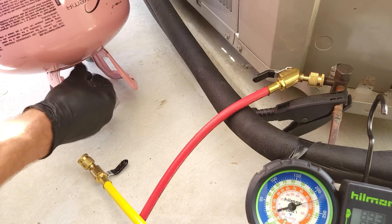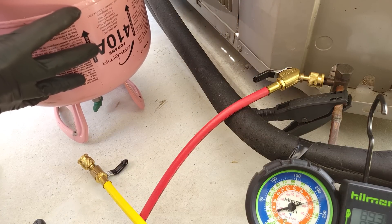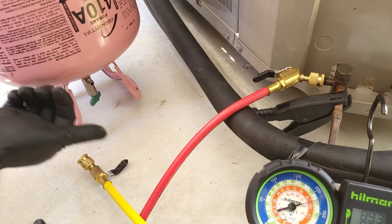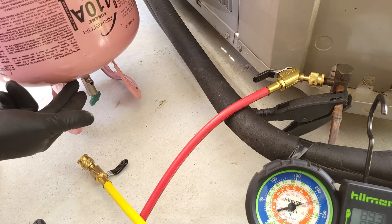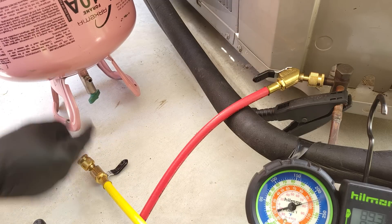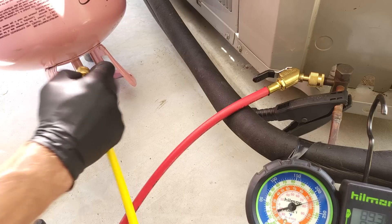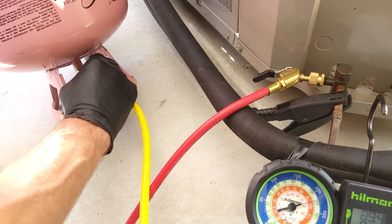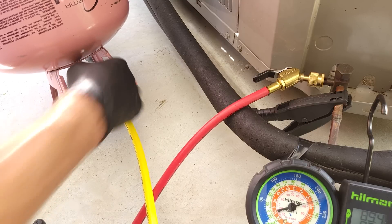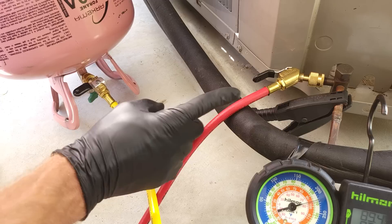Next, we're going to remove this cap off of the R410A bottle. Since this is a disposable R410A bottle, we're going to have it upside down because we want liquid to exit from the tank. If this was a non-disposable bottle like a recovery cylinder, you'd want to have it upright because there's a dip tube in order to get to the liquid. But the whole point is that the refrigerant is mixed — it's a 50/50 mixture of R32 and R125 — and you want it to maintain that mixture. That's why we take it out of the bottle as a liquid and put it into the system.